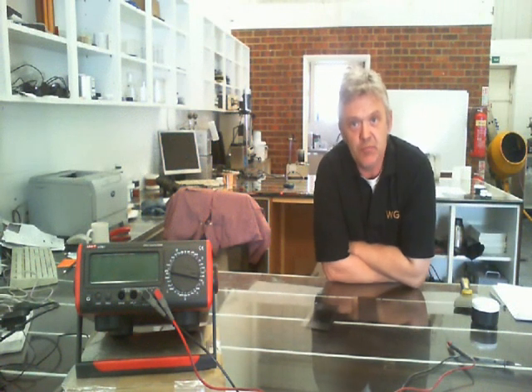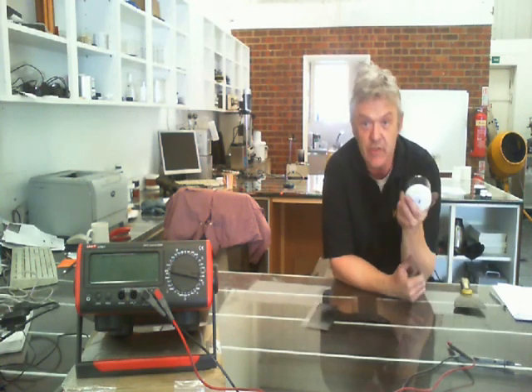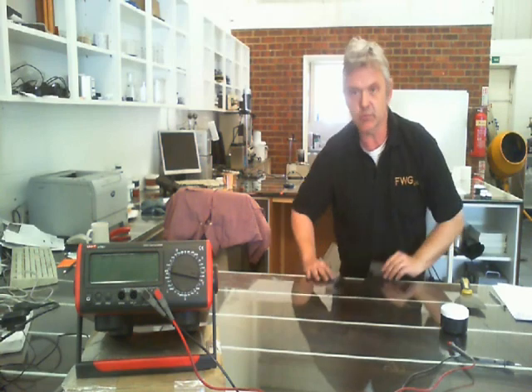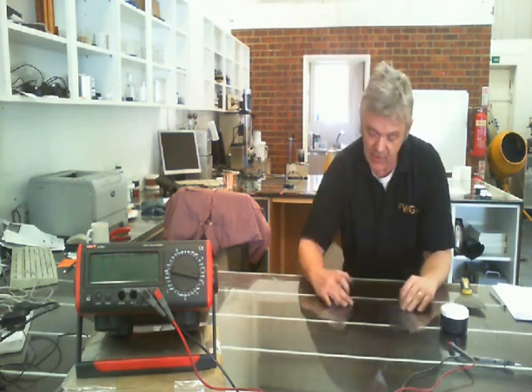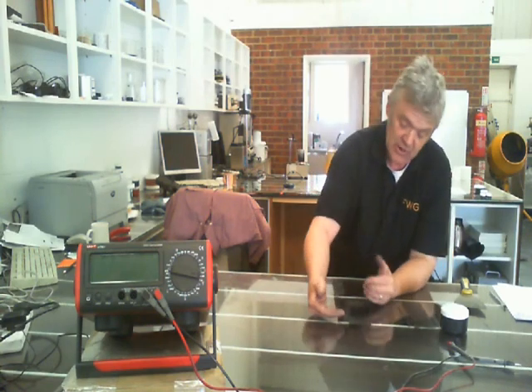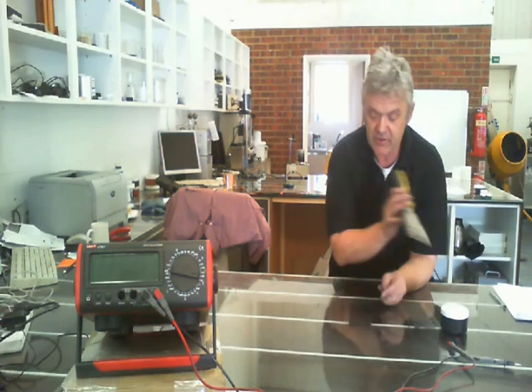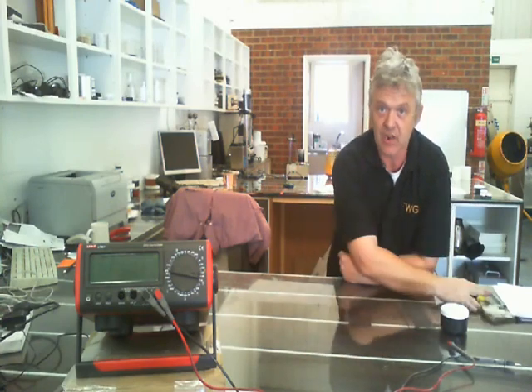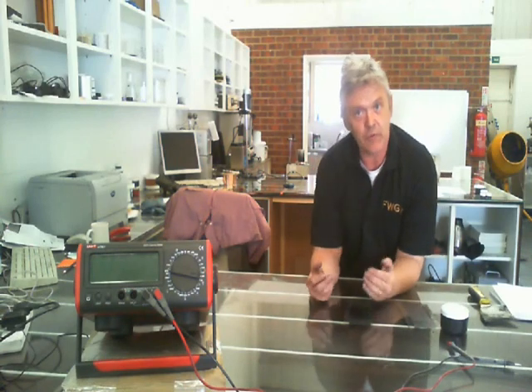Hi, so me and Mel Kahn have been working on this — it's based on waterproof conductive ink. What I've done is made up two separate plates. I took a couple of bits of plastic, some strips of tape, put a teaspoon of ink on it, and wiped over it a couple of times until I got an even coat. That's called the Dr. Blade method.